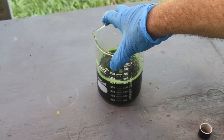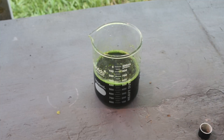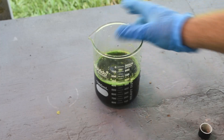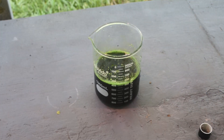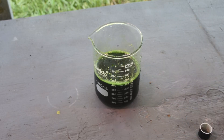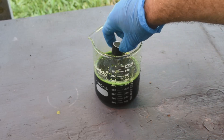Now I want to try and get the copper out of this stuff. Basically, all we have to do is put a more reactive metal than copper into this copper-saturated acidic solution, and the copper should start coming out — it will cement out as the more reactive metal goes in. I've got a little piece of aluminum here. I'll put it in and see what happens.